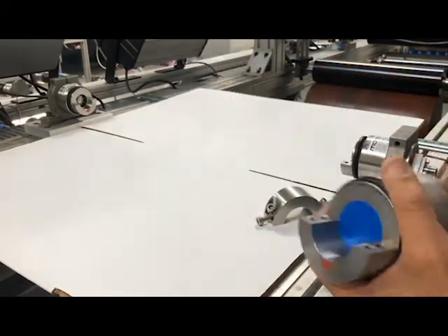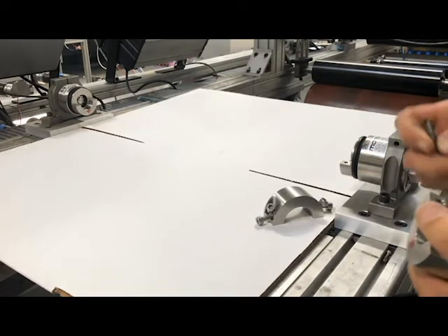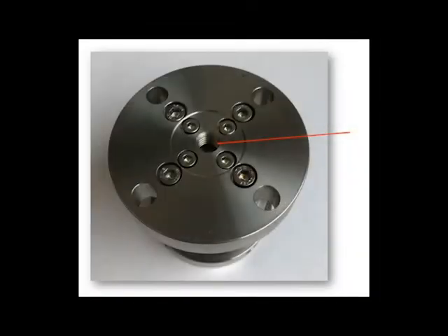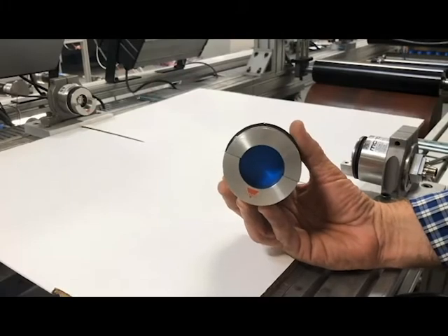For the standard and pillow block mount, go ahead and secure them to the machine frame. If you're working with a flange mount style, begin by mounting the load cells using the center bolt to aid in alignment and positioning during install if possible. The other four bolts will be attached and tightened after the installation is complete.